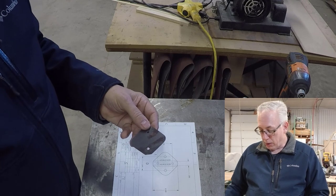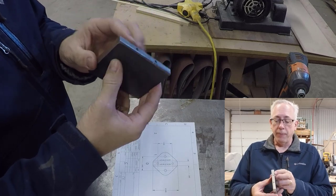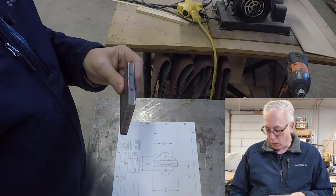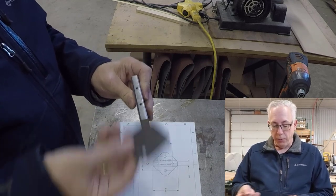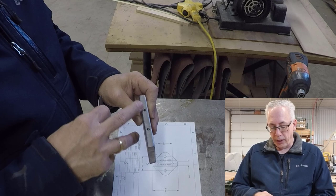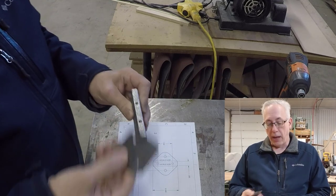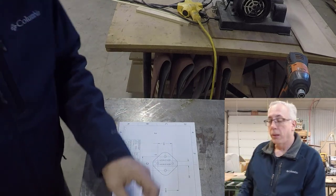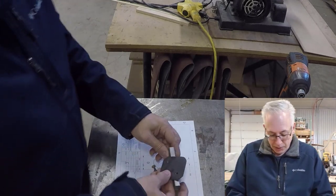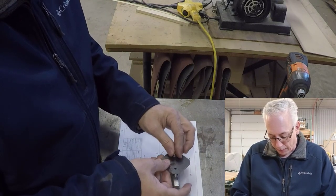And so what I then did is I created this flanging block, and it's just a piece of 1/2-inch material. We took it over to the mill and set it on the mill, and then we marked the first hole right in the center, drilled it and tapped it, and then we fastened this right on, centered the second hole, located it, drilled it and tapped it. And so now, and I'm just going to grab the screws, you can take this piece and mount it onto this flanging block. Get it to go here.